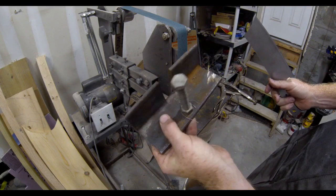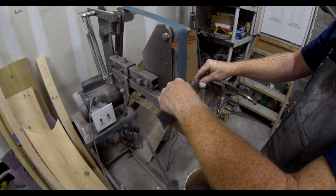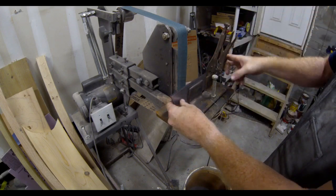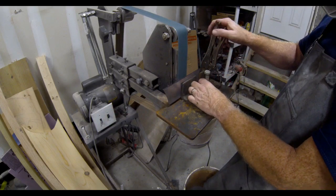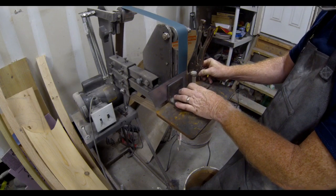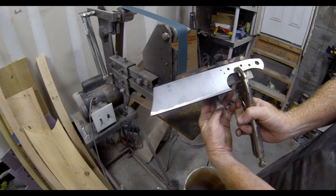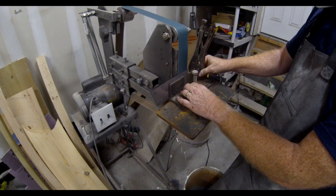As far as knife making goes, it's a very easy build. I started the process by mounting the blank onto a bevel jig. For this particular project you probably don't even need the jig, because it's a cleaver and I really don't want the bevel lines to be distinct or to show. I'm just using the jig as a way of uniformly grinding both sides of the blade close to the center mark. I'm using a 2x72 belt sander with 80 grit paper; I marked the center of the blade with a marker, scraped the center, and then watched that from the top of the blade on each side, going back and forth making passes.